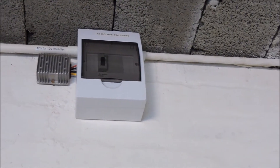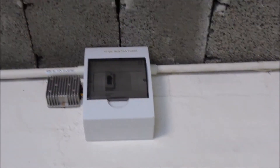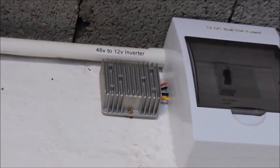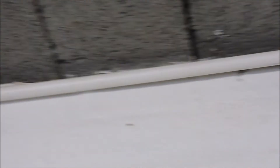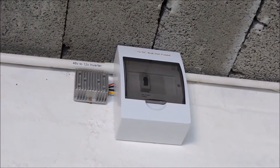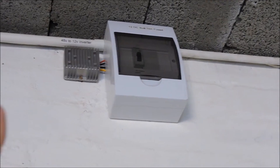That DB board has a breaker — it's an AC breaker which is rated for DC, so it's a 20 amp breaker really used as an isolator. Next door to it you'll see my 20 amp DC-to-DC, 48 to 12 volt converter. Then I've run through some cabling up into a second distribution box where I've fitted 2.1 millimeter DC connectors so I can plug appliances in there. The cable coming in is 1.5mm at 48 volts and going out is 2.5mm at 12 volts, and the distances are relatively short.